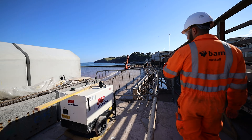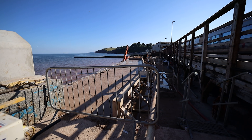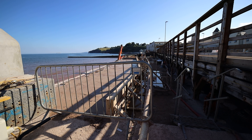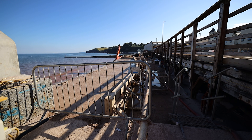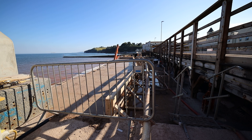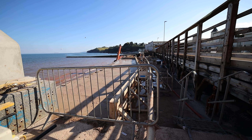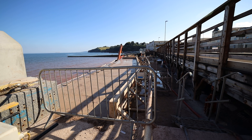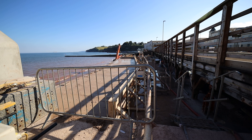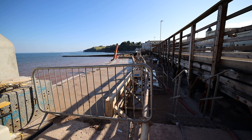This is a section of concrete that we've just poured today — that's the last pour of the mass infill concrete in this section. We'll strip these shutters tonight and pour the other half tomorrow, so it's a very quick process. How long does it take to strip the shutters? It normally takes anywhere between 12 and 16 hours — we strip it at the back end of the other shift and then erect the opposite side and pour this section tomorrow up to the top of the facing panel.